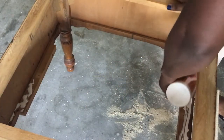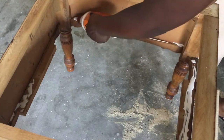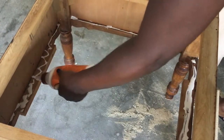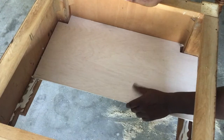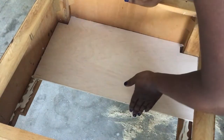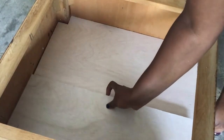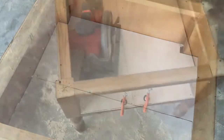What I'm doing right here is putting glue all the way around the edge of the nightstands, because there's no other bottom to the nightstands at all. Once the glue is down, next is putting down the boards that I cut. Because of the little notches at either corner, I ended up having to cut them in half in order to fit them both in. Once they're glued in, I'm just placing them down, and I did that for both nightstands.